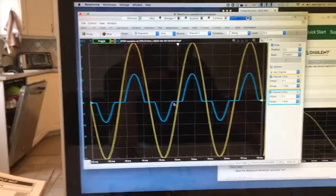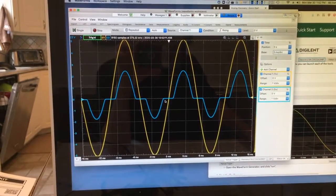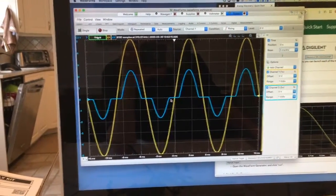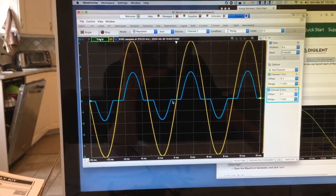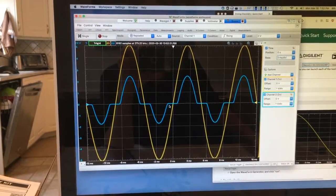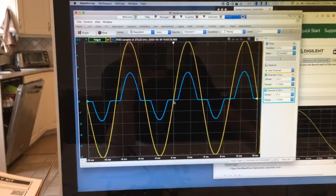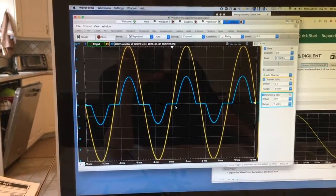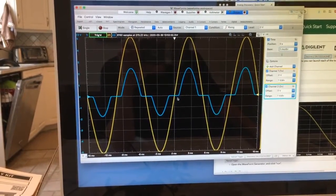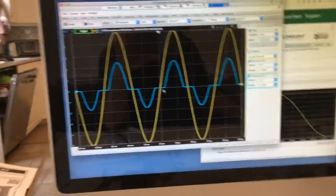You know, if you wanted to prove it, you could take a Circuit Lab model and see if you can reproduce it, and then you can artificially change the gate capacitance of the MOSFET in the model. And you can see whether by dialing that physical parameter being simulated, you can reproduce what you observe. So you could do some kind of neat physical modeling just by comparing your observations with a Circuit Lab simulation whose parameters you can tweak.